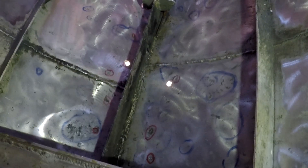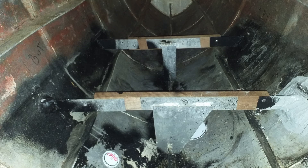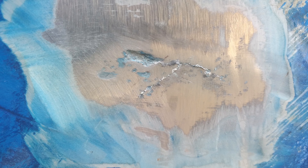We've got this pitting down here. What we also have is there used to be a floor in here and some floor members, and they were welded on right here, and I've cut them off now. There were four of them — four sides. And there's cracking around them. It's probably hard to see, but there's a slight crack happening there. That's because it didn't have a doubler plate, so the force is just point loaded right on the top of the piece of metal holding it together.